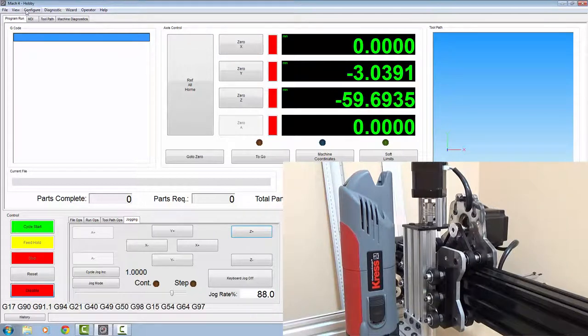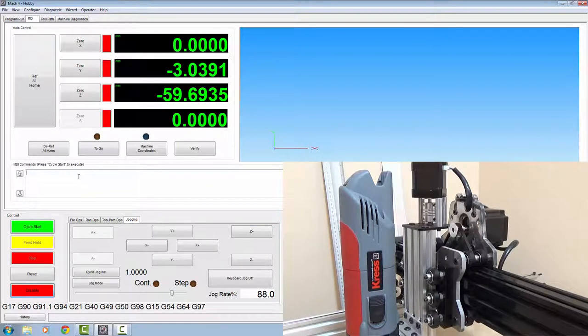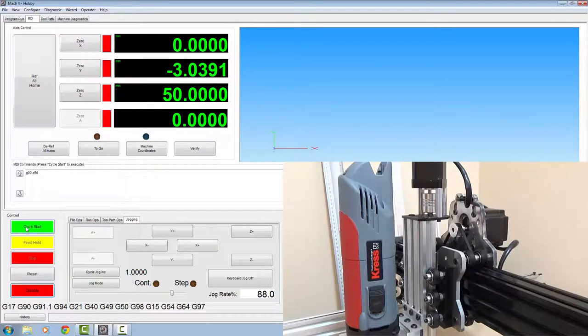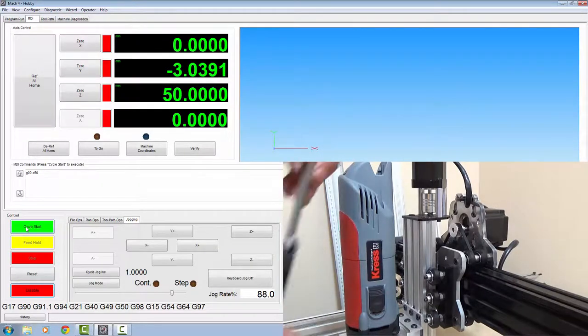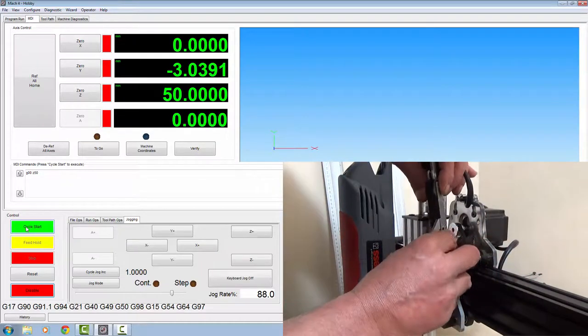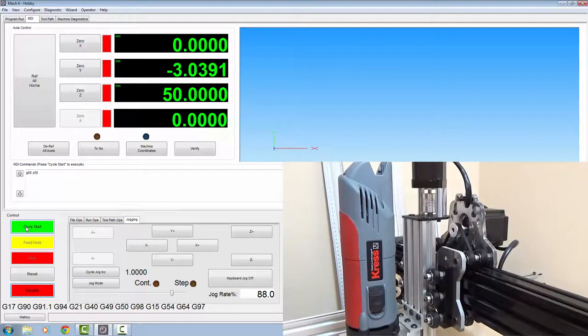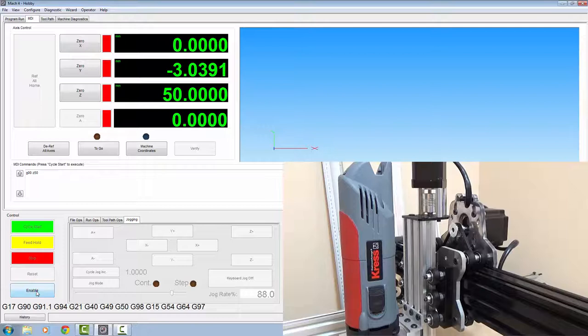Go across to the MDI. And we're going to give it the G00 command again, and it's going to be the Z axis, and we're going to move it to 50. Before we do, just zero your Z axis out, otherwise it's not going to know where to go really. Press cycle start, and then we'll measure, see how far it went. So we've zeroed out the calipers. We've gone 12.48. So disable,